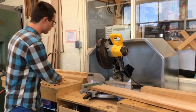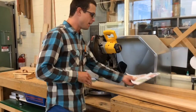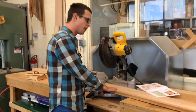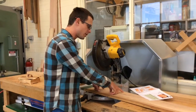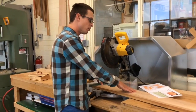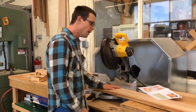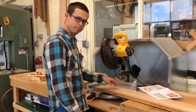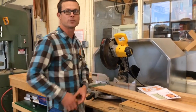Then you need to figure out rough lengths and widths of the pieces you need. What I did is I am building the sides and ends first in step one. And so it's 5.5 inches for the ends and 9 inches for the sides. So about 16 inches will get each piece. They're only 2 wide, so I should be able to get quite a few of them out of here. Okay, so I just need one 16-inch stripe. I can get up to 3 2-inch widths out of it, and I'll even have some extra.